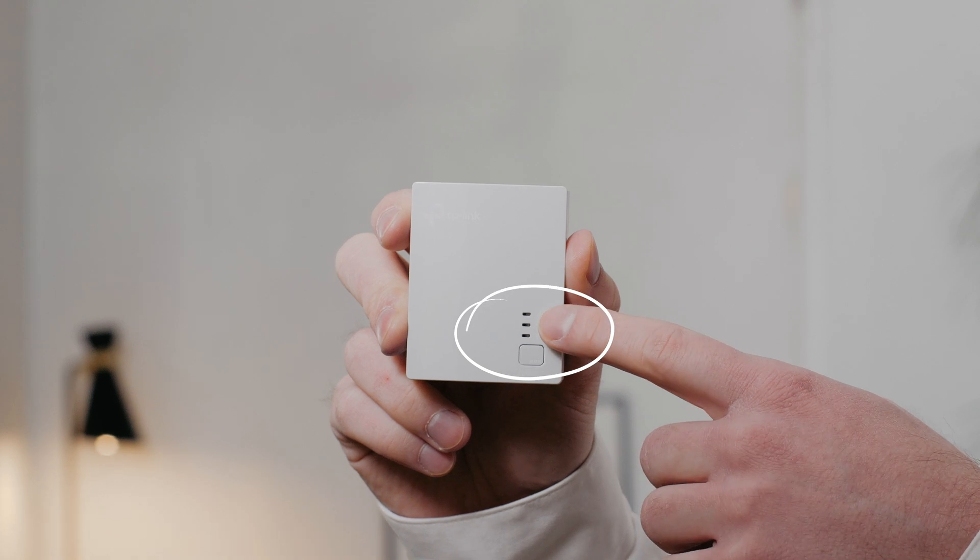This is your bridge — the device that allows you to connect your solar system to the internet. If one of the three lights is out on your bridge, it's not working properly. Don't worry though. Getting the Envoy back online is actually pretty easy and it only takes a few minutes.